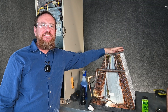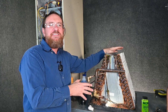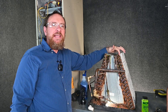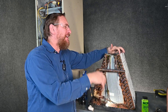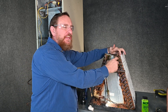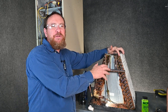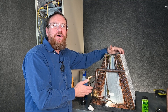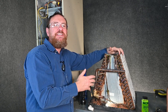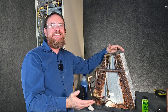What about fixing that evaporator coil leak? Most of the time on residential systems, we're not going to be fixing these coil leaks — we want to identify where it's at, but most of the time you're looking at replacing that evaporator coil, whether it's under warranty or not. The problem is, if one of these are leaking, it was done in a factory in perfect condition with nitrogen flowing through. Now I bring my torch out and heat up this connection to fix that leak — it's also going to heat up all of the other connections around it because of how close all these tubings are together. That usually ends up causing a leak in another spot. The risk for fixing an evaporator coil is very high. It doesn't mean I haven't fixed leaks in an evaporator coil, but the risk is high that you could have a leak someplace else. So it's going to be the customer's call — do they want to take that risk trying to fix it, or invest money in replacing the evaporator coil, or in some scenarios, replacing the entire piece of equipment?